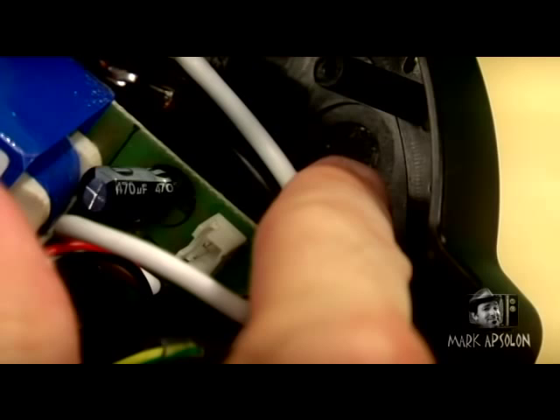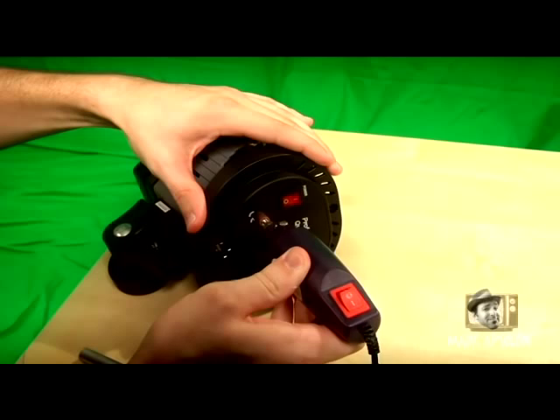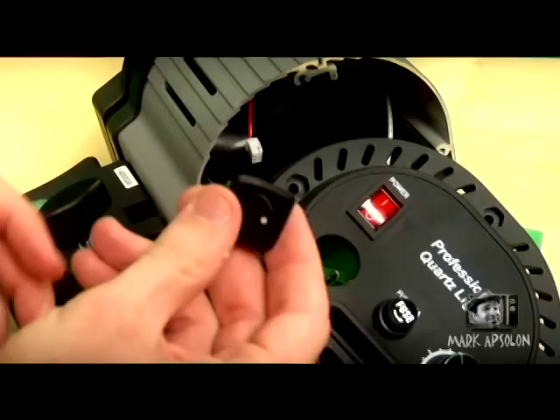On the very bottom of the back of the unit, there is a hole next to the other three switches — the fuse and the variable control. It's located right underneath where the power switch is. You can take an exacto knife and carefully remove that area. It's a pretty small hole, so for our switch we'll need to make it larger. If you have a snap-in switch you may be able to just snap it in, but otherwise use a dremel or a drill to enlarge the hole so the switch fits easily. Always use your mask when using a rotary tool.